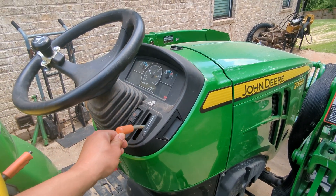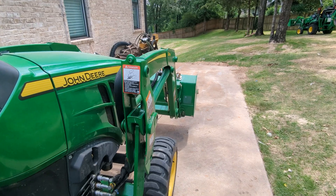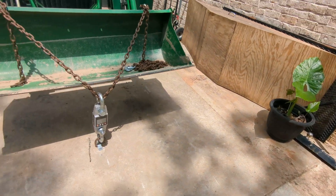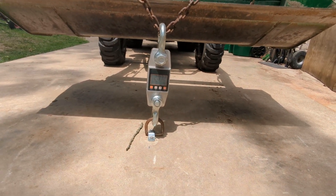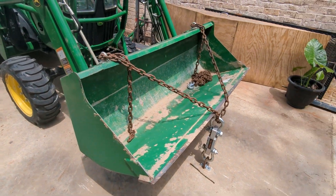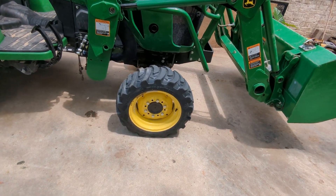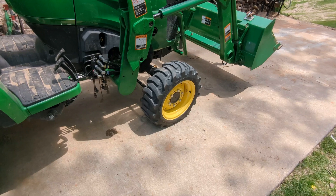Let's just go all the way up. Back wheel's still on the ground — no surprises there since the two-inch cylinders were on the ground too. Reading 2072. So you can lift very much — without question, I think it can lift a ton off the ground, probably at least to this height, if not higher. At 2000 pounds you get a little squat on those tires. These tires are certainly better equipped than the one-series tires to lift that kind of weight.